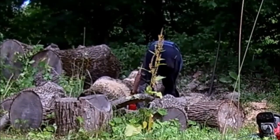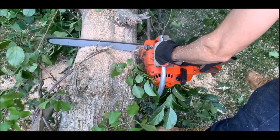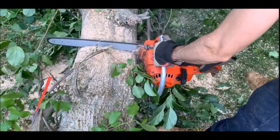Well, that's not supposed to happen. From all the other YouTube videos on kickback, which you should be watching for safety — never ever ever cut with the tip, that point on the top. It's not a lightsaber; we're not talking Star Wars. You have to cut downwards. Use the bottom part of the tip if you're doing a plunge cut — enter the tree and then gradually guide the bar into the bark, or into the tree. Typically you're doing a cross cut, not going with the line of the fibers.